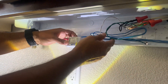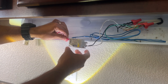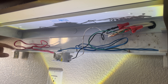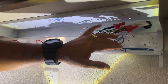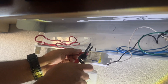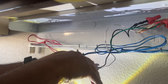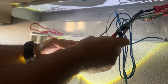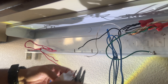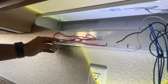Next, I'm going to cut the wiring that's connected to the ballast — cut the blue, cut the red. I'll show you how to rewire it and we'll be done. I have two red wires going to one tombstone and two blue wires going to the other. I'm cutting the red and the blue, and then we have the black and the white going to the actual ballast.